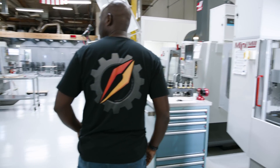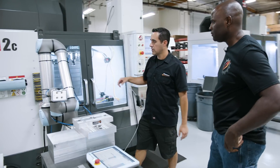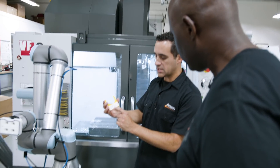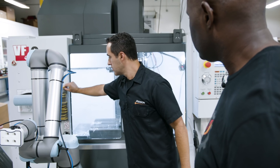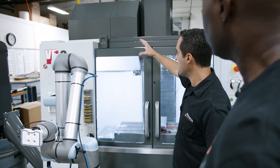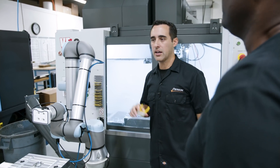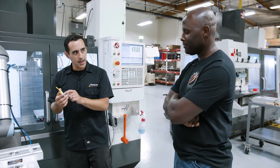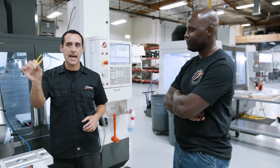30-tool changer. If we have tool number one, we get that gauge length, we know what the diameter is, we know it's an end mill, we know it only works for aluminum — that's going to be used in pocket, tool number one. That's our tool number one. That way, if we need to pull that, this information travels with the tool, so we don't have to do another setup. We don't need to figure out, oh, it looked like quarter inch — but it says 187.5. Every tool is tagged in the shop; if it's not tagged, no one owns it.